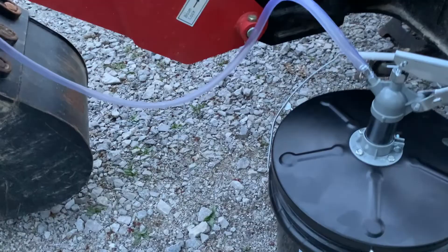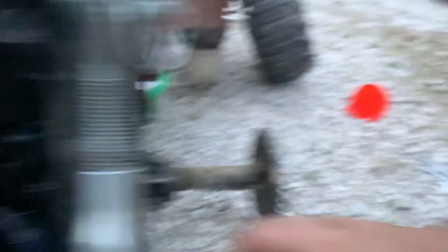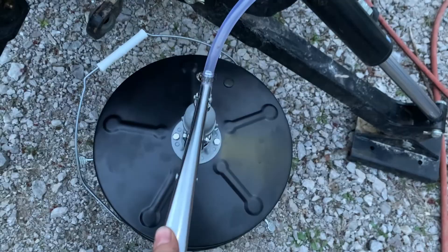Last part — hydraulic fluid into the system. On the back of the tractor, there's this cap we already got taken off — goes right there. Five-gallon bucket. I highly suggest you invest in one of these handy pumps — I picked this up at Tractor Supply, had the whole thing for the top of the bucket. It's like $55, but good investment because this ain't the only time we're going to be doing it. So that goes in there, and then it's just crank away.